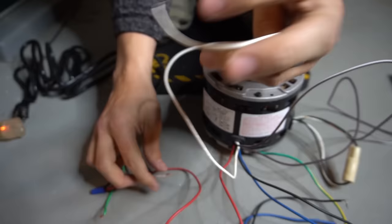Heat can be various speeds — often the lowest speed (red) or a medium-low, but I do see heat wired to different speeds. There's also a fan section, which corresponds to the thermostat fan setting. When you switch the fan to 'on,' it energizes whatever speed is plugged into that terminal. Then there's a 'park' terminal, also called 'spare,' 'm1,' or 'm2' on different boards — this is where you plug in unused motor speeds. For example: red (low) to fan, black (high) to cool, common to neutral, blue (medium) to heat.